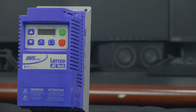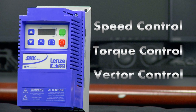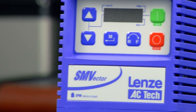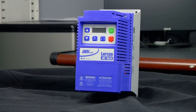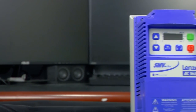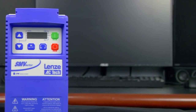Today's video will look at the SMV's motor control capabilities. A motor can be controlled in one of three ways: standard speed control, torque control, or vector control. Out of the box, the drive comes pre-configured for speed control, which allows for basic speed control of a motor using the integrated keypad at any acceleration or deceleration your machine can handle. The SMV works extremely well for power-demanding applications, delivering up to 195% torque to full speed in under 8 seconds. It can also recover from 100% shock load in 0.15 seconds, and run the motor from 0 to full speed in a third of a second.